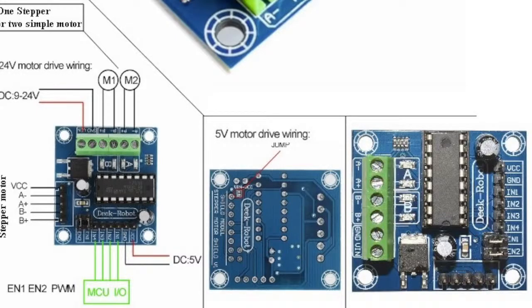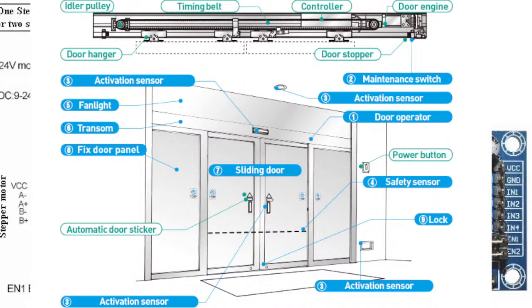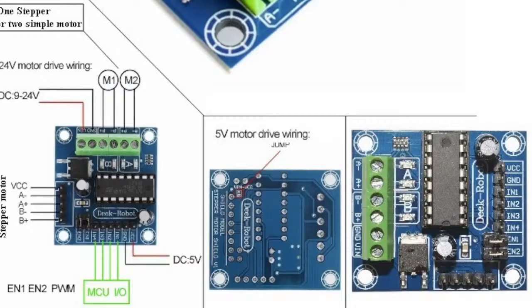So you have to include a delay over here. Let's say the motor turns clockwise for opening the door and anti-clockwise for closing the door. When it rotates in clockwise direction, the door opens, and in anti-clockwise direction, the door closes. So you'll add a delay, which you can choose on your own. Let's say for 1 second when you rotate the motor clockwise, the door will be opened. And for 1 second again, if you rotate it anti-clockwise, the door will be closed all the way. You can make use of this logic, turn the pins of the motor driver on and off, and simulate this.